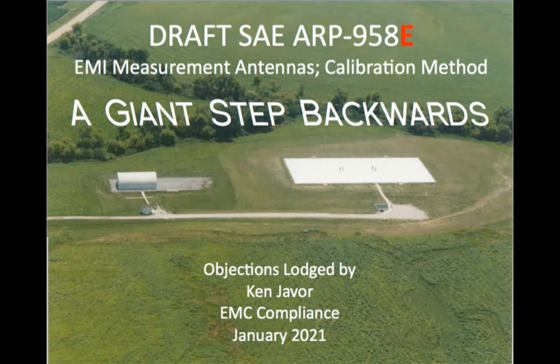The proposed E revision requires separate horizontal and vertical antenna factor calibration for dipole-type antennas, like the biconical and the log periodic. The original release was in 1968 and covered only log spirals, so this wasn't an issue. Revision A in 1992 added other antennas commonly used in shield room tests, including the biconical, log periodic arrays, horns, and others. Revisions B, C, and D followed with minor changes. Draft E, with this new two antenna factor requirement, is another matter entirely.